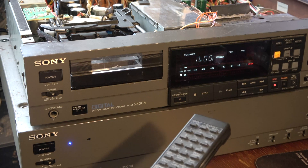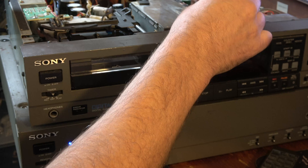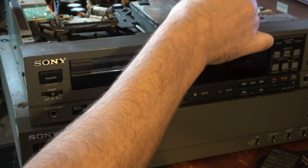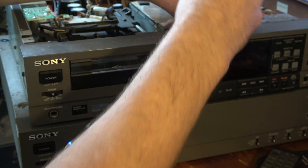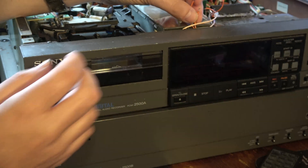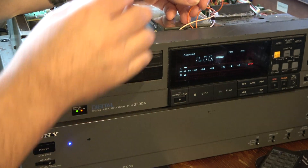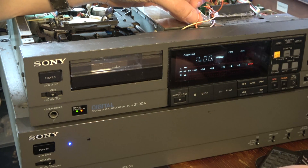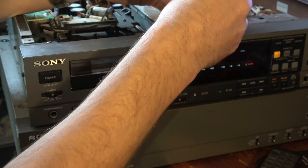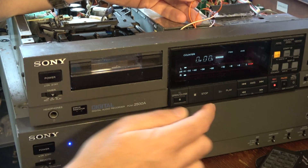There we go — that's the mode we're looking for. These are the two wires that go across the record switch. If I short those together, I go into record mode — confirmed. And yes, the resistor works fine too. So the IC should have a low enough on-resistance. The problem could be a fault on the board or a bad IC, so I've got another 4066 here. Let's take the IC out altogether and confirm we don't have a fundamental error on the board.